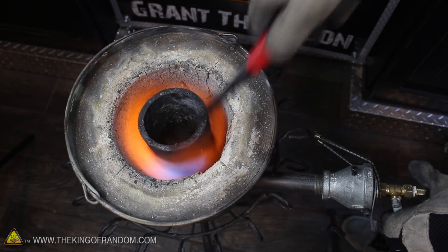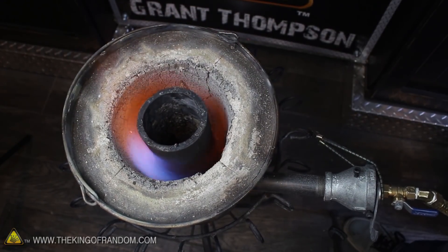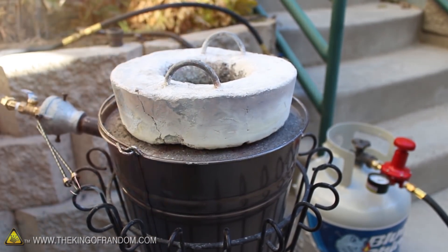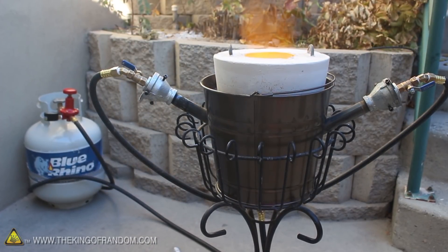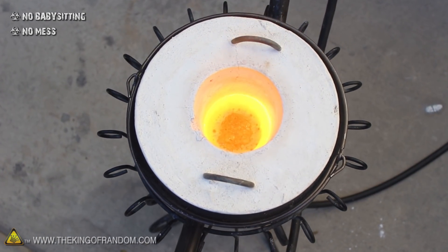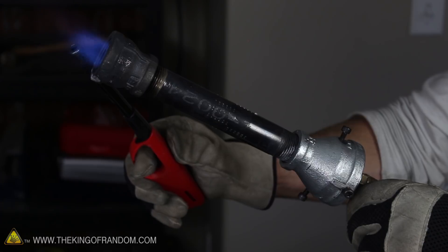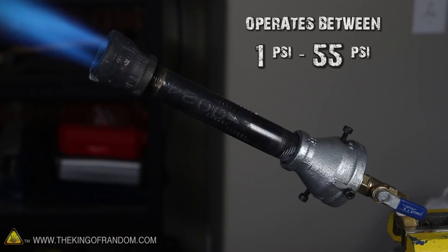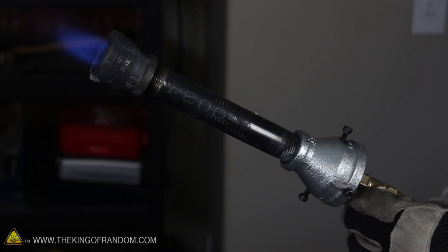Add a little gas and light it off with a BBQ igniter, then adjust the air flow until you see the flame tighten into a fiery vortex of metal melting power. This setup can get really hot in a hurry, so quickly put on the lid and stand back. In as little as 5 minutes, the inside of your foundry will be glowing red hot and you'll be melting all your favorite metals without any of the challenges you had with charcoal. There's no babysitting, no mess to clean up afterward, and you'll probably be saving money as well. The gas blaster is designed to self-regulate and sustain a healthy flame from 1 psi all the way through 55 psi without even flinching — meaning you can run your foundry as hot or as cool as you want just by regulating the pressure from the propane tank.